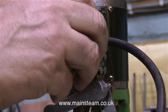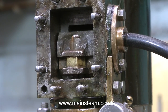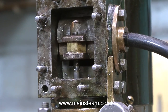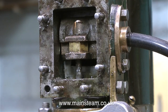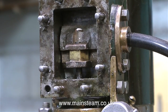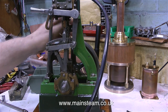I have to post a warning on this next bit — it's really boring. If you are prone to slipping into a coma, it's possibly time to get up and make some tea. It's not boring for me actually doing the job because I'm quite busy looking at the ports and seeing how the valve is travelling over the ports. It's time to remove the valve. I took the valve out and re-profiled it because the metal plate that was soldered onto the front of it was too big and in the wrong position.